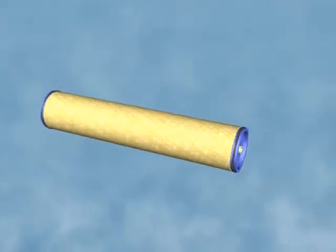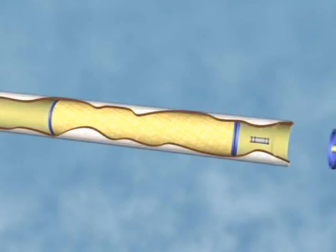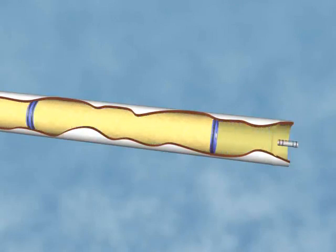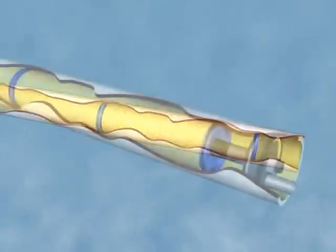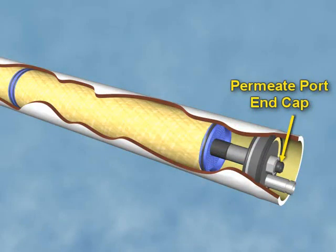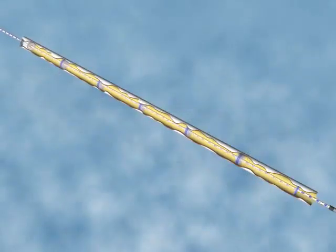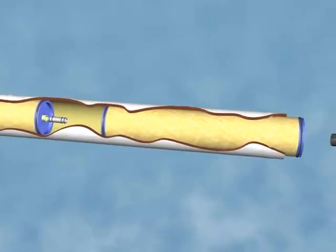When 6 elements are placed in a pressure vessel, male couplers connect the product tube in each element to the product tube of the next element. This interconnection allows permeate from all elements to exit the pressure vessel in either direction. Typically, one end of the pressure vessel's product tube is capped while the other is open to allow product water to exit. The couplers generally have double O-rings on each side.